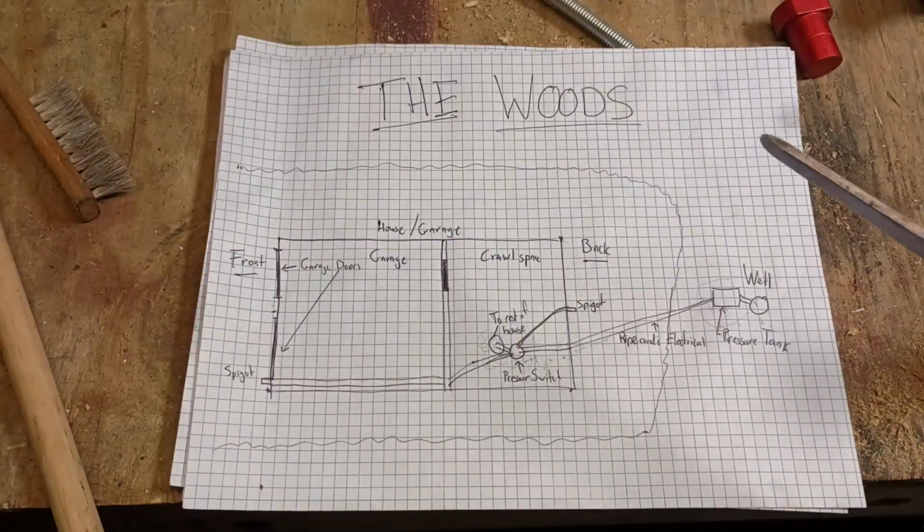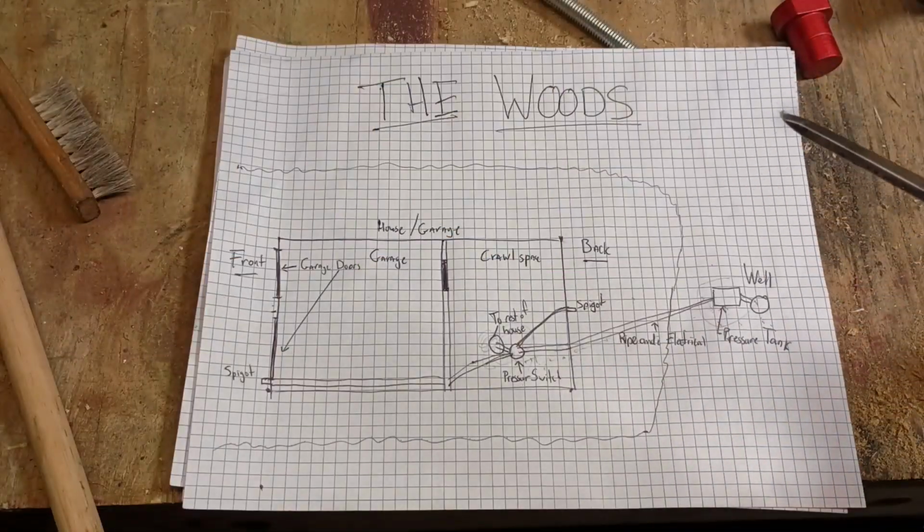So I think the pressure tank is starting to go. So I'm going to turn on my faucet here, and what you're going to see is the water pressure cycling from low pressure to high pressure. This is because I think the pressure tank is not able to keep a steady pressure once the well pump turns off. So you'll see that the well pump has to constantly cycle on and off to keep that water pressure.